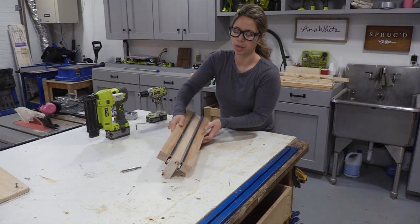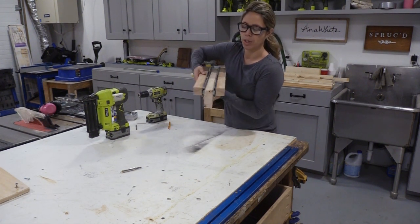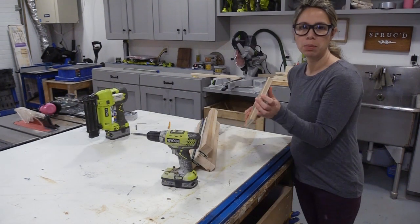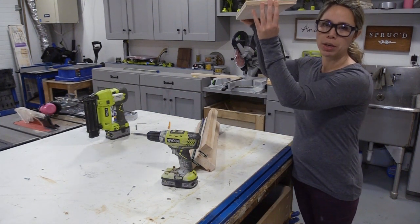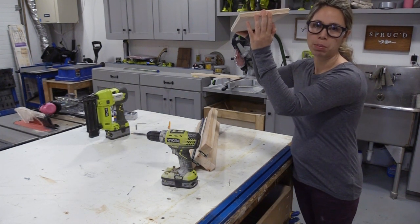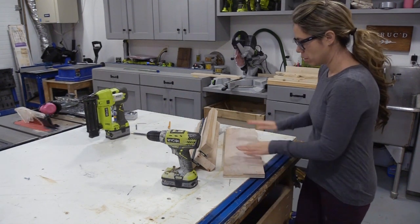This is all going to work like this, and the middle part will pull out. I need some way of attaching it to the top of the cabinet. So I have a piece of plywood — you could use a 1x8 — cut to the depth of the inside of the cabinet. Measure the inside of your cabinet and cut a 1x8 or piece of plywood to fit. It can be bigger but you don't want to go much smaller.